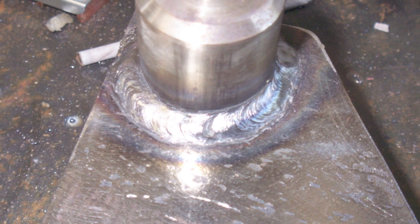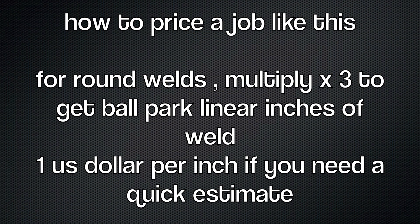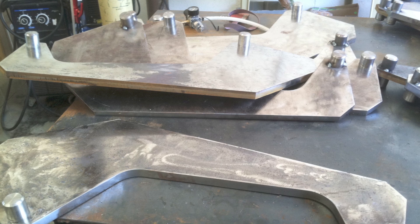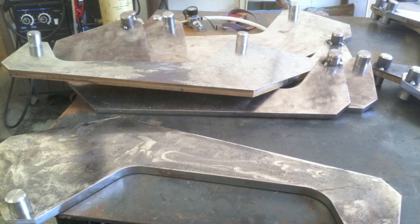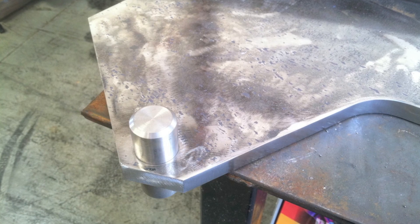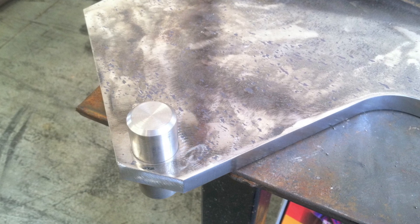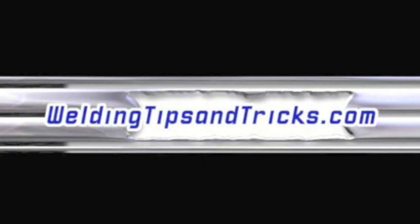Both welds are okay — nothing to write home about, but I'm going to practice and get better. A lot of people take on jobs like this and have no idea how to price them. Here's a tip: for round welds, multiply the diameter by three to get a ballpark of the linear inches, then charge a dollar an inch. That might seem a little high — if it is, go down to 75 cents or 50 cents an inch, whatever works out right. At least that gives you a way to figure jobs without losing money. You can quote a job off the top of your head and not lose money at a dollar an inch. Of course it's different in different countries, so figure out what makes sense. That's it for today — lots of random tips.